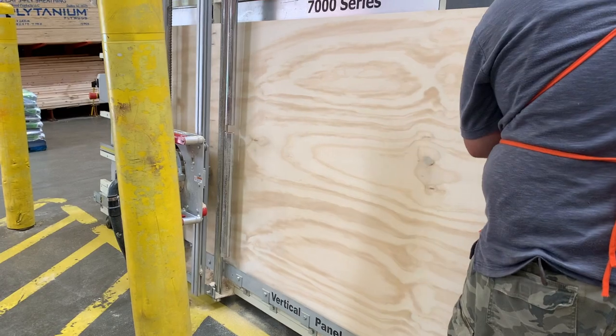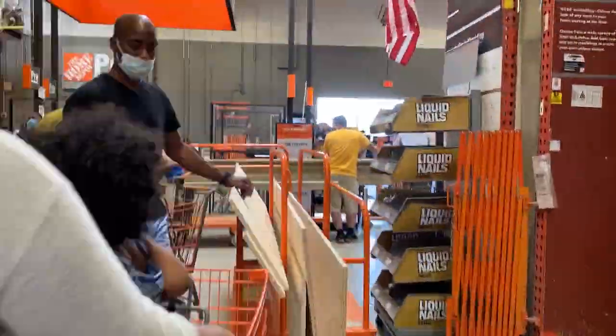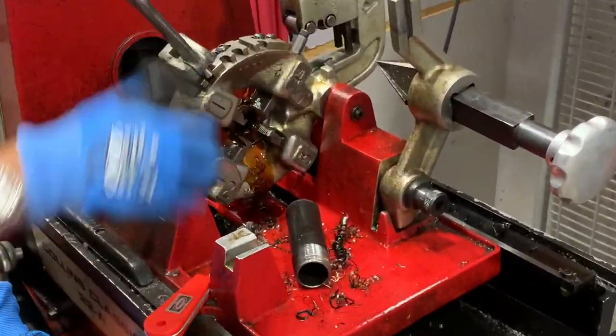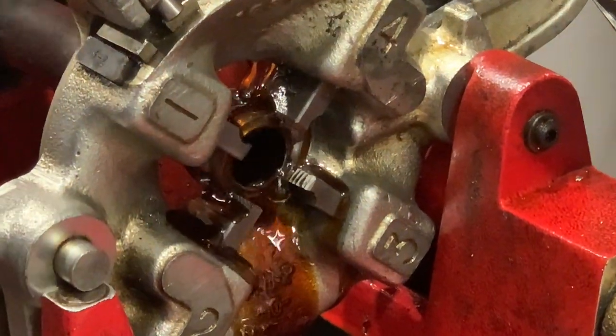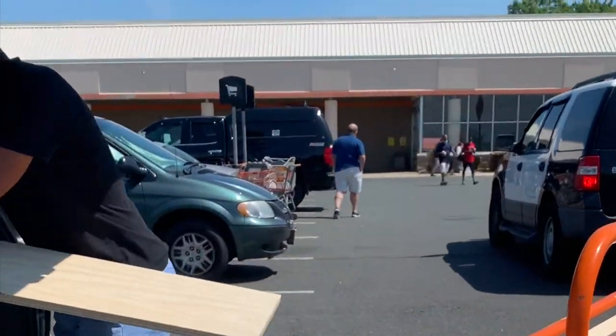So we decided to have the 3/4 inch plywood pre-cut for us, two pieces at 18 inches high, and two 25 inch width pieces for the sides. This gave us a head start to finish our project. We also purchased wrought iron pipe for our closet and had it pre-threaded on the spot. This made it a quick, easy installation.